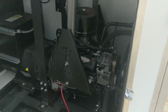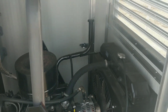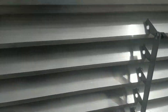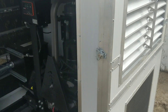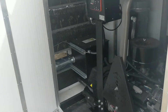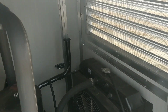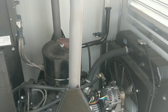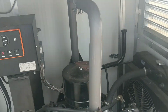As it's operating, there's going to be a vacuum in here, as I'll try to demonstrate. This louver on the front is a nice addition — it's adjustable, so the operator can close it off and make a tighter seal and a vacuum inside. Or they can open it up and regulate the air flow, which basically just regulates how much air is being pulled from the ASICs side versus how much is just coming in and circulating at the front end. That just helps the operator regulate the engine temperature or the ASIC temperature — if one's getting too hot, or if it's too cold in the winter, you can open that up and circulate warm heat back into the building.